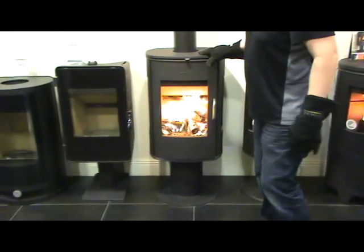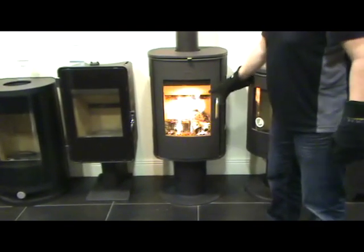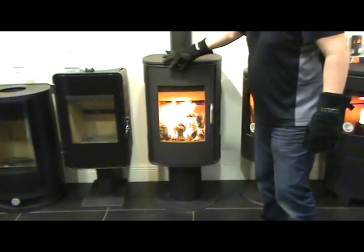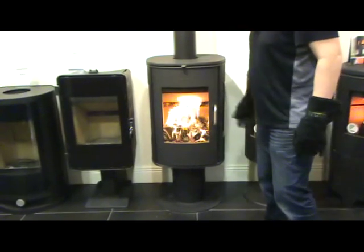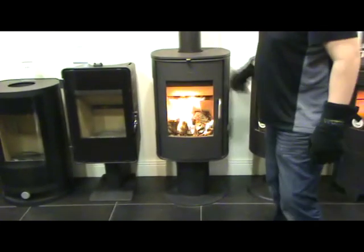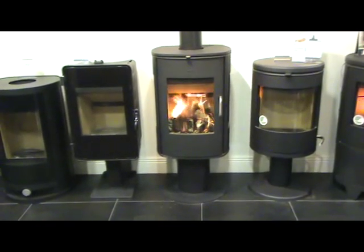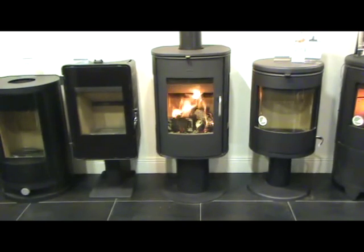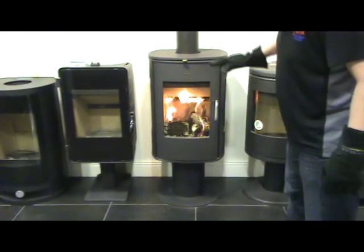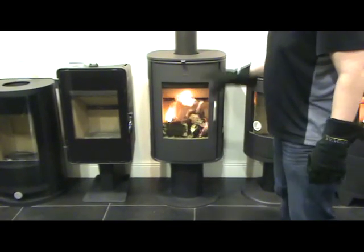The stove has been lit about 25 minutes now, the first refuel is carbonising and it's looking very nice. What I'm going to do is just turn down the air control on the Morso — we don't need to be burning quite at the rate that we are. You can see immediately when you turn it down the flames start to calm down. We get these little bursts coming from the tertiary air jets — that's just the hot air coming through from the flue gases. It takes about a minute or so for it to settle once you start to calm it down.